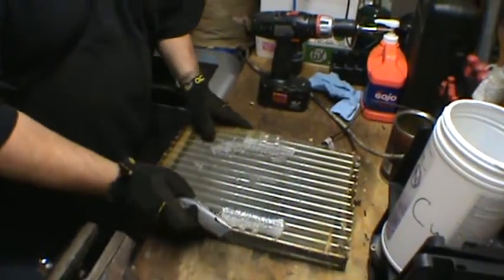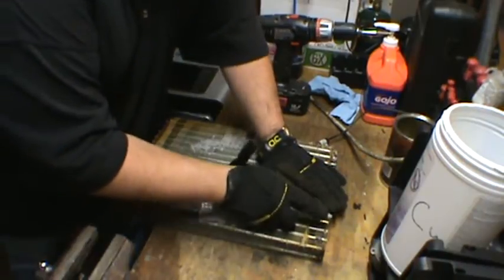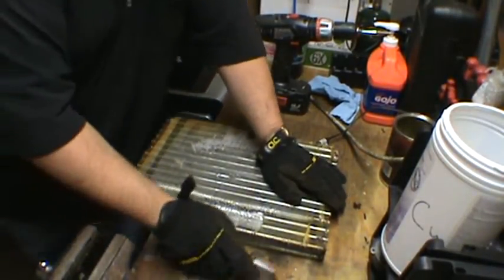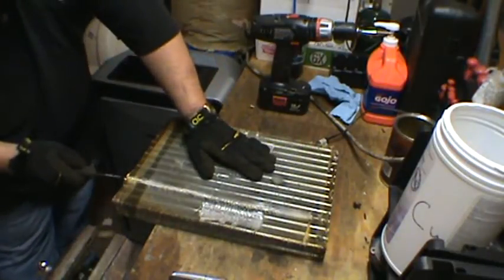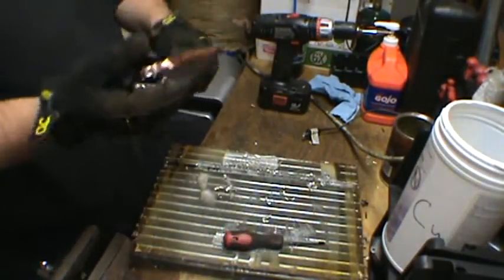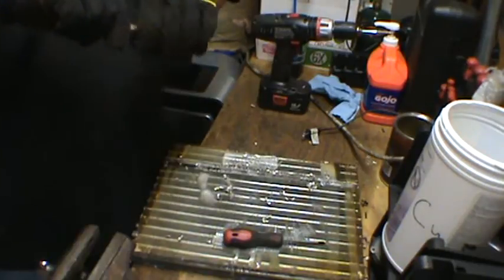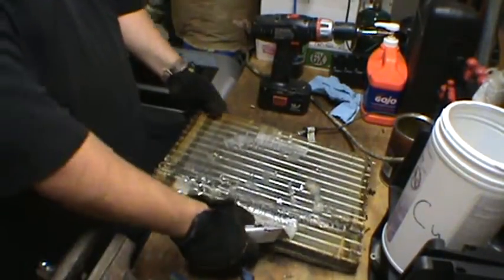So what you do is start at the top where you see one of the copper pipes coming through. With your utility knife, go right down the side of it, as close as you can. Then stick your screwdriver in and you can pull the copper tube out. There's your copper pipe. It's usually not that difficult — for some reason it was wanting to be difficult for me. These little aluminum fins will come right off, they'll be stuck with the aluminum plus copper tubing.